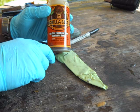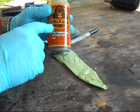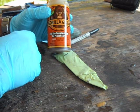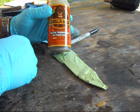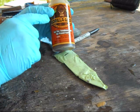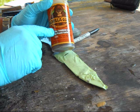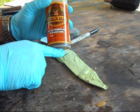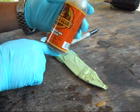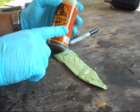But I dropped a knife, just dropped it, didn't throw it, and it had been epoxied on with Devcon 2-ton epoxy, and both sides of the handles just flew off. So I did a little testing, and I can make them come off if they're not pinned with this, but it's a heck of a lot harder. This is 100% waterproof. There are variations out there that are not. So make sure you get the Gorilla Glue, 100% waterproof, bonds wood, stone, metal, glass, ceramics, foam, and more.